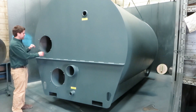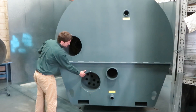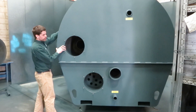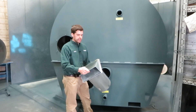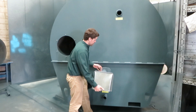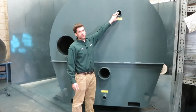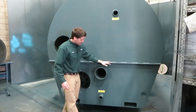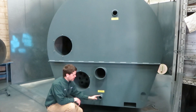Here's the back of the unit. This is a collection box for the multi-tube, and this is a collection box slash clean-out for the flue. This is the air inlet ring — it's larger than the 1500, 2000, or Junior but connects in the same way. Just like the 1500 and 2000, we have a hot water supply flange up here — it's a three-inch connection — and a hot water return pipe connection down here, which is a two-and-a-half inch connection.